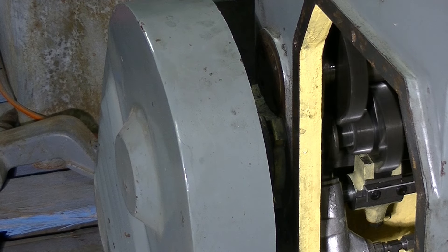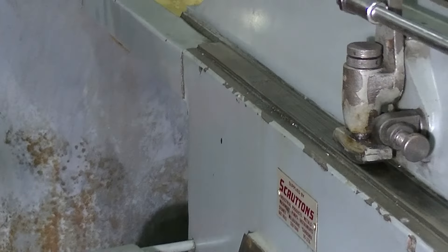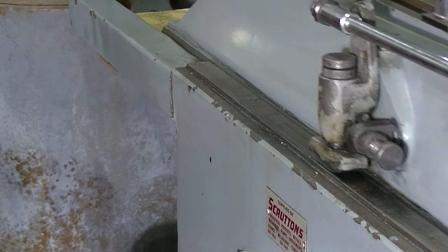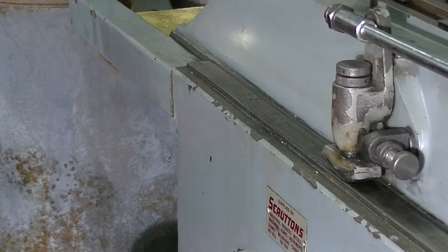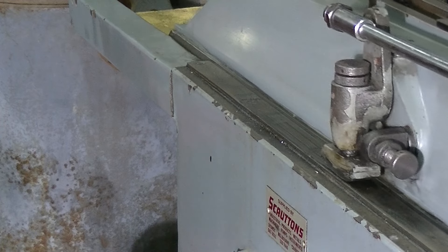Well, this is what we wanted to see - the oil's bursting out of it everywhere and running like it should be. I've got to say it picked up very very quickly. Maybe it was just another machine that had a fault right from the start. We'll let it run for a little while, make sure it's going to be reliable, and I'll put the camera around the other side so you can see the sight glass filling. It's going to be good to have the old girl up and running again. I'm going to have to readjust the oil feed - otherwise the slipper for the clapper retractor is going to be sliding. I think it's already over-oiled. Success - I'll put the camera on, cut it down, and then show you how the oil glass fills up really quick.